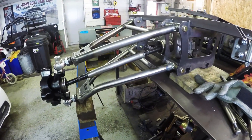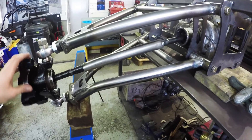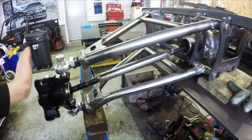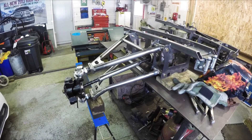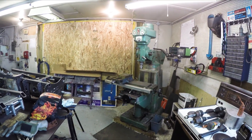The front's all mocked up and I put the extension in the axle so I have the correct length now. I'm going to pull these guys out, cut the blanks of the 4340 steel, and then head over to the mill, get the dividing head set up, and we'll start cutting splines.